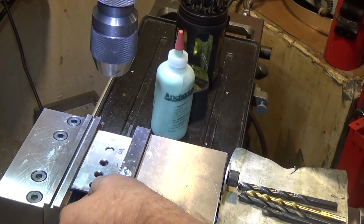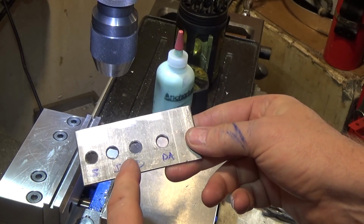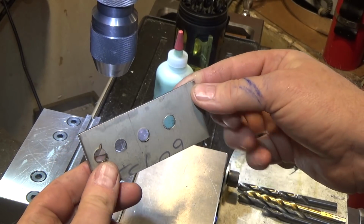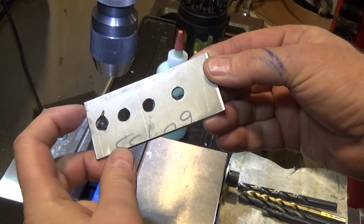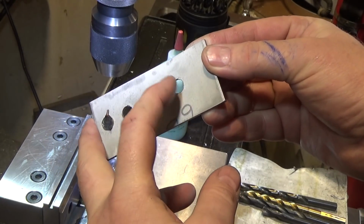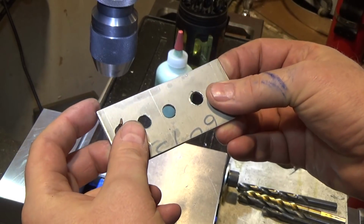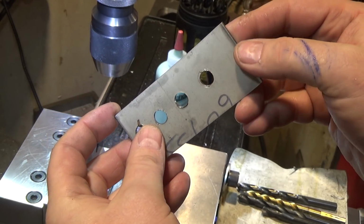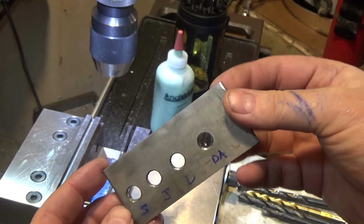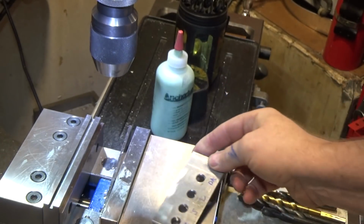Alright, so we'll pop over to the bench and take a look at these 3 screw machine size, jobber, DeWalt, Drill America, and an interesting comparison between the exit burrs on all of these. Drill America has the least exit burr, sort of tied with the jobber, yeah, about. Actually, it's a little better, just a tiny bit. Anyways, let's head over to the bench and compare sizes. Remember, this one it lifted, so we can't really go with that size.